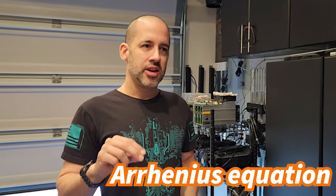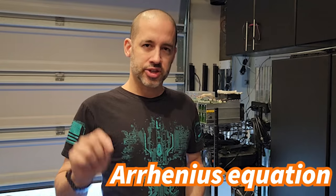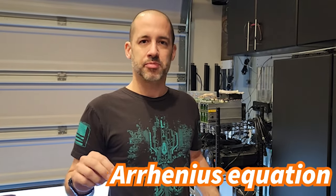The other reason we went with this cooling solution is because I came across a general consensus about electronics — the rule of thumb that for every 10 degrees C increase, you theoretically lose half the life expectancy of your electronics. So if you're running 10°C higher than before, you're in theory halving the life expectancy of that equipment. We definitely want to run these things for as long as possible, so running them much cooler is going to increase the longevity of these miners.